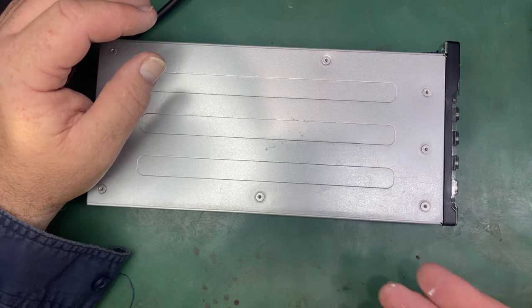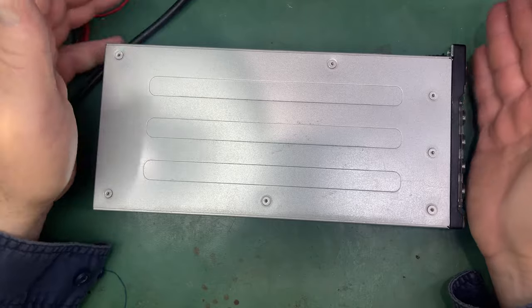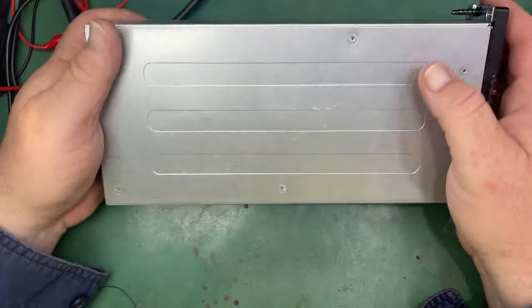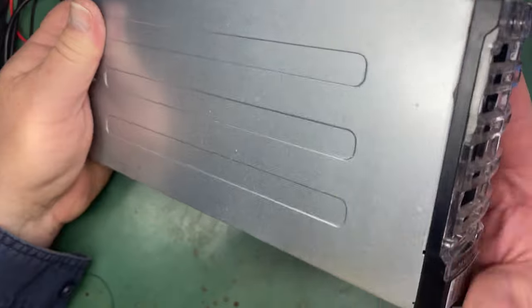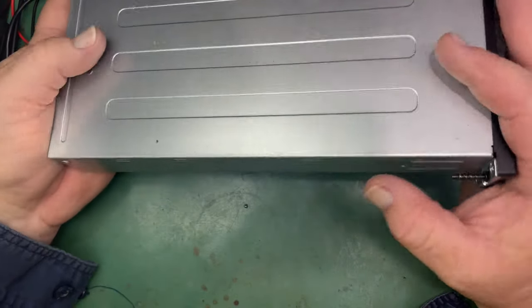The other fault that shows up is a weird one. The rectifier will shut down if one of the fans stops spinning — it has two fans inside. The rectifier is smart enough to recognise that the fan has stopped, and it will just shut down and go into a fail mode.